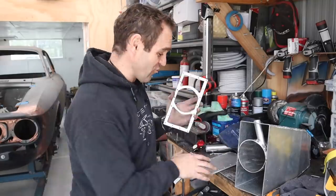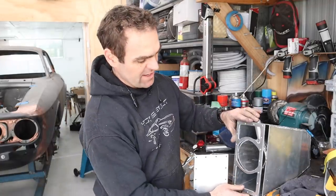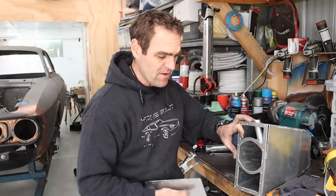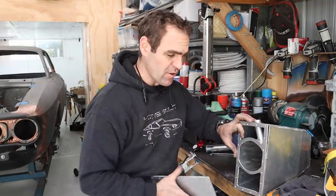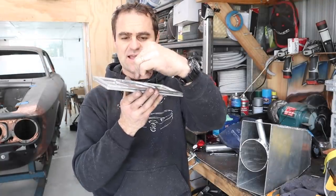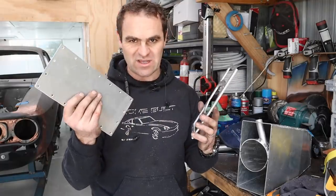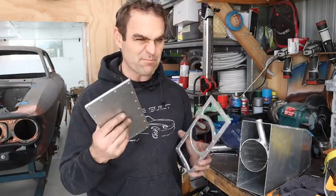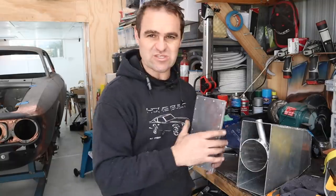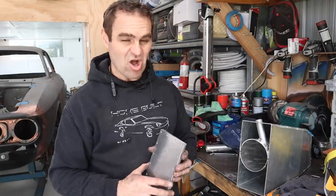That was a lot of cutting and grinding to make up a couple of plates, but it may start making sense now. What I've got here is the top plate of the box — it's going to sit on here like this with the center tube, and then this is going to be the lid. This piece will be welded on and the lid will bolt on over the top. It's nice six-mil aluminium plate so I've actually been able to tap and thread the top plate so that I can bolt it on. I've probably gone overboard with the number of bolts — it's not holding any pressure, this will not be a pressurized system — but it will help to keep a good oil seal on here. The next step is to work out what I'm going to do as far as baffles go inside of my tube.